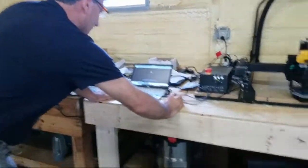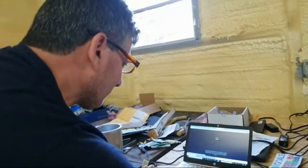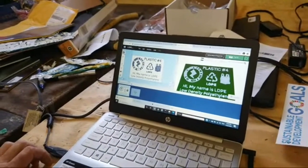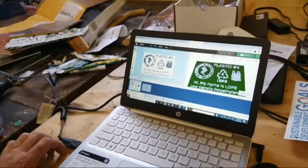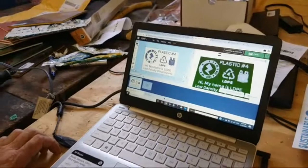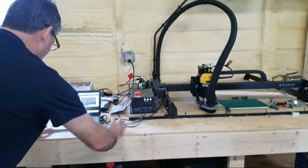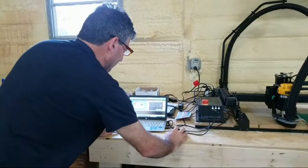It's going to show up in a second once it gets online and pulls it offline. It says it's waiting. Okay, there it is. This is what it's going to look like when it's made. Note, as I showed before, that the zapper code has to be inverted when you place the scalable vector graphic or SVG file in, so that when you carve through the green part of the HDPE, you will expose the white, because the zapper uses white for the zapper code and wants dark colors for the little widgets that define what the code is. So that's critical that you have an inverted image there. Anyway, this will show up green here if it's ready to start talking to the machine.